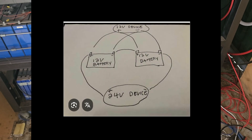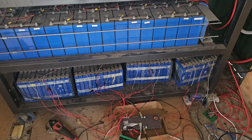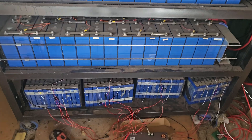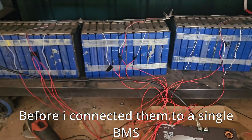For starters, you can't have series and parallel connected — you've just created a dead short. And when you're talking about independent 12 volt batteries, like this big pack here, that's just one solid continuous pack. But those ones on the bottom, they're actually independent 12 volt lithium batteries.